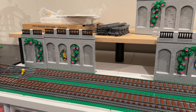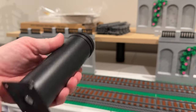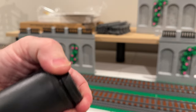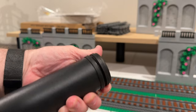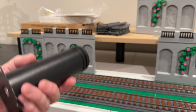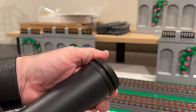These are adjustable legs, which is really important because the floor in my house is not straight. I've leveled the cabinets as best I can, but sometimes they're just a little bit off. You can get these on Amazon — they're very inexpensive and metal. They just screw right into the bottom of your wood, and the adjustable foot part lets you fine-tune it to level off the top precisely. I used to use two-by-twos cut down with shims, or even Lego bricks underneath, which was kind of chintzy. These adjustable legs make leveling really easy.